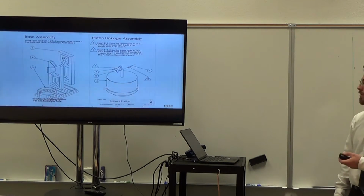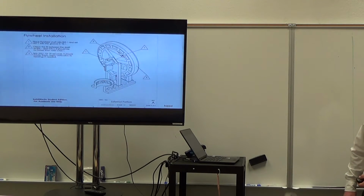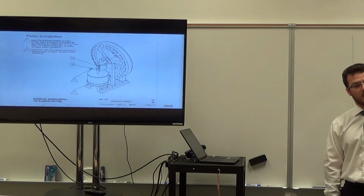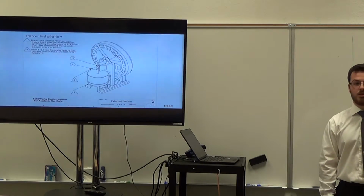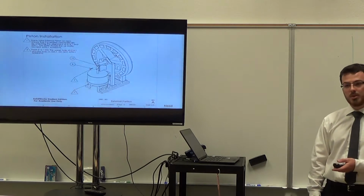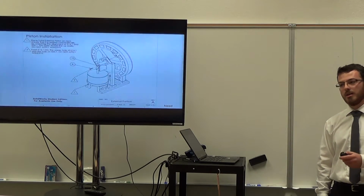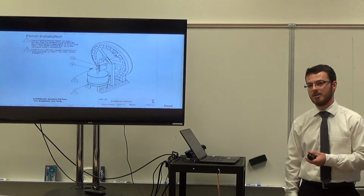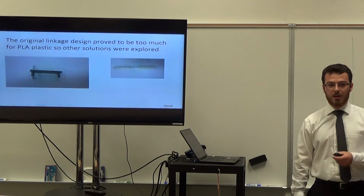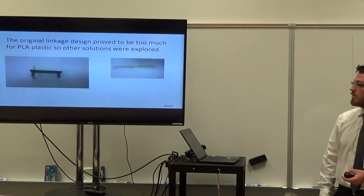So here's the connection of the cylinder to the flywheel. This one and the next one. Yeah, so here we originally used PLA pins for the connection. We found out that under high shear stress, they break very easily. So we then switched to a high toughness SLA printed part. But we found out after we printed them that high toughness materials, or at least this particular material, did not have very high stiffness, which was also a requirement. So, that's this slide. So we ended up having to abandon the printed parts altogether and repurpose some pins we found at Harbor Freight.